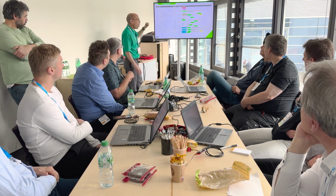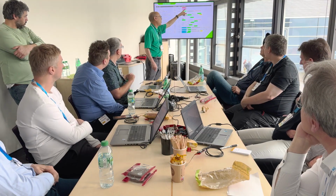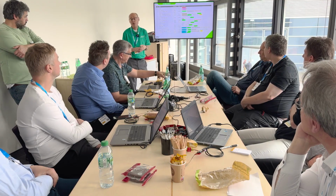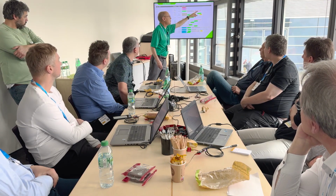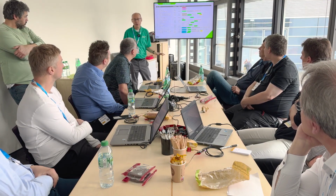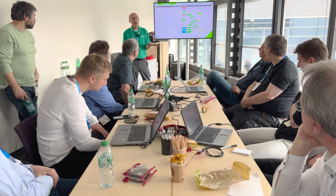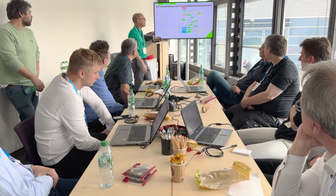And often the other two pins that you'll connect are maybe the UART for data in and data out. So that's if you're talking to a host device over the UART. Notice there's also a secondary UART available, so you can talk to two different things over the UART. Maybe one is for user configuration, maybe the other is to talk to another component in the system.